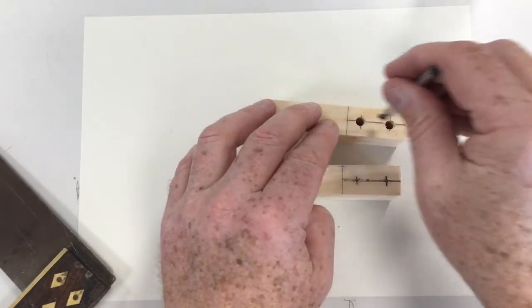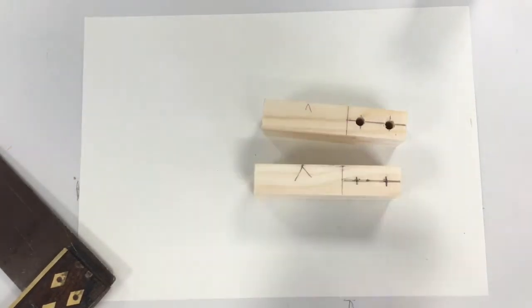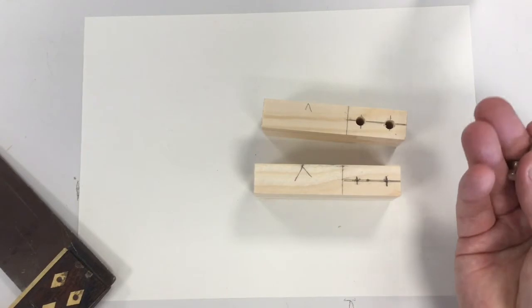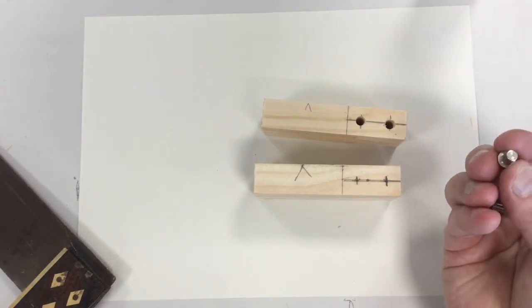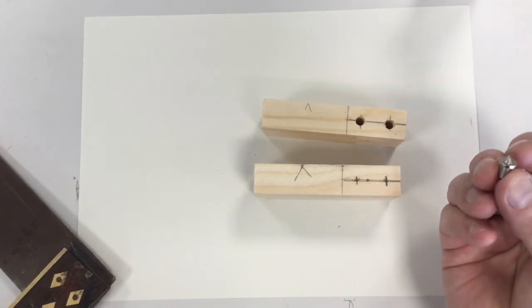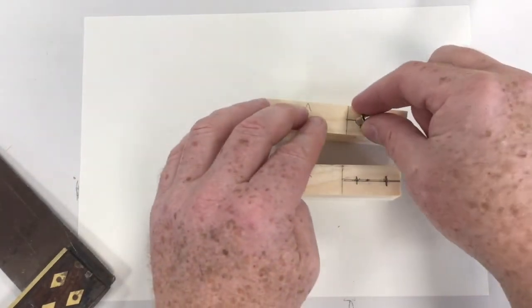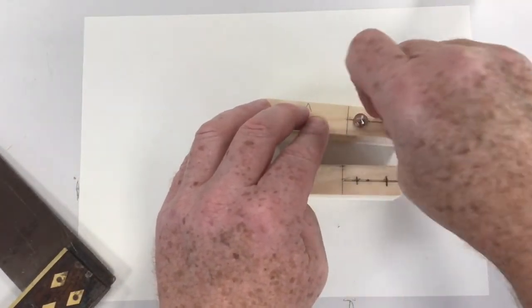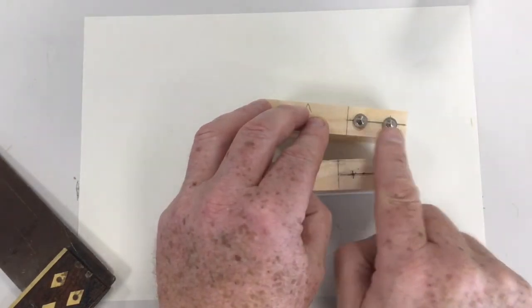What we do first is we drill these 2 holes, and then we take these markers. These are called dowel markers, and again these are the same size. These are 6mm, but they've got a wee pin on the front. So once you've drilled your hole, you put these dowel markers in, and you've got these 2 centre points.